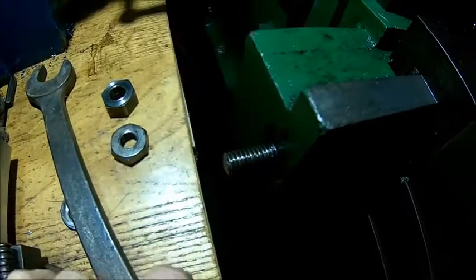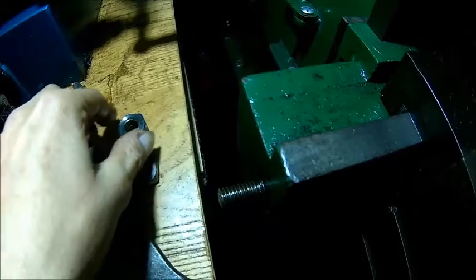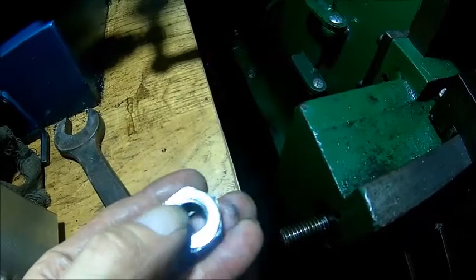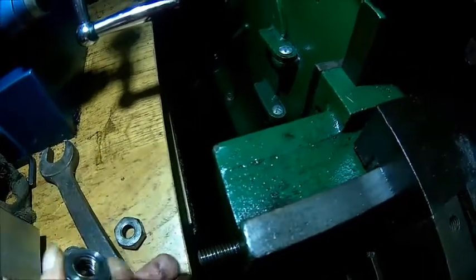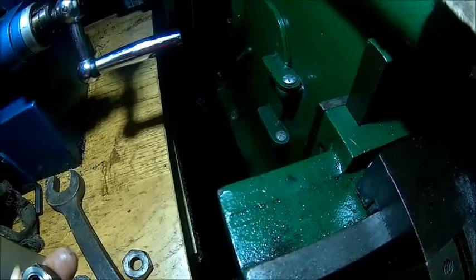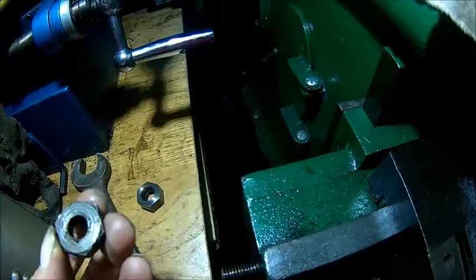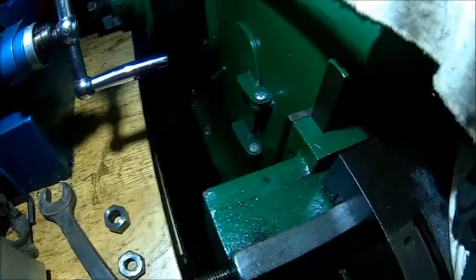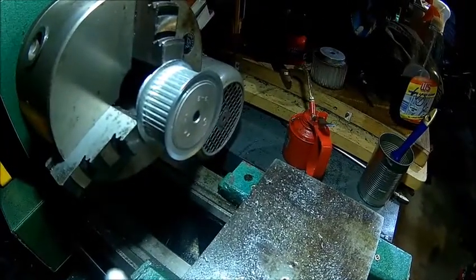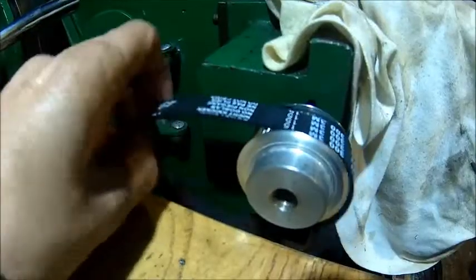So we tried to figure out what the thread is on that end. It was just a washer pushing against that, and the nut has really worked its way into the washer here. This is half-inch BSW — half-inch Whitworth, confirmed. This nut doesn't look really nice either. So what we're going to do is drill that to the core size for a half-inch Whitworth, which is 10.5 millimeters, and then we'll tap it. And that's how it comes together.